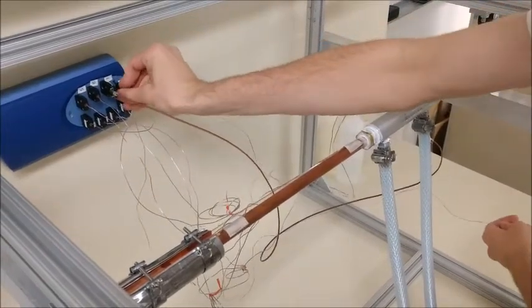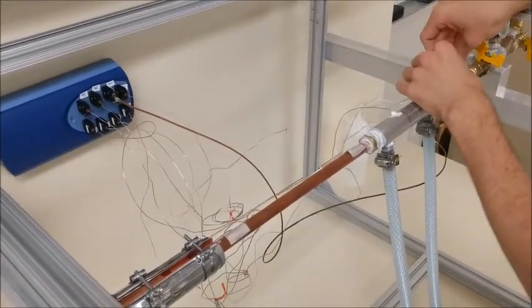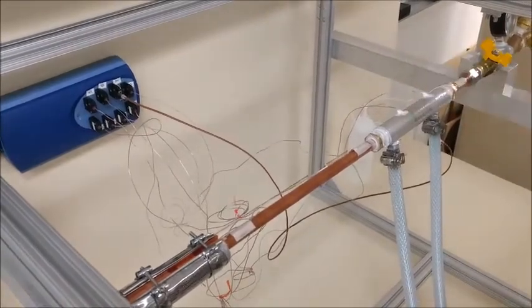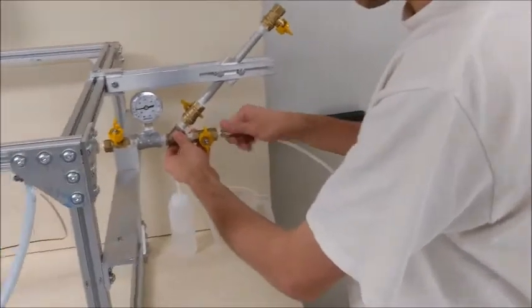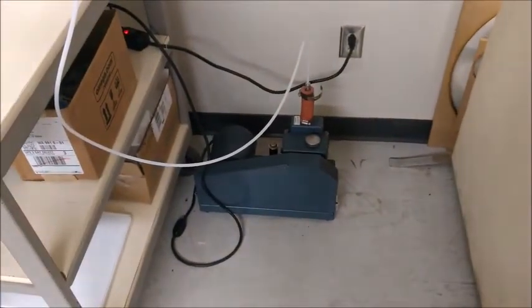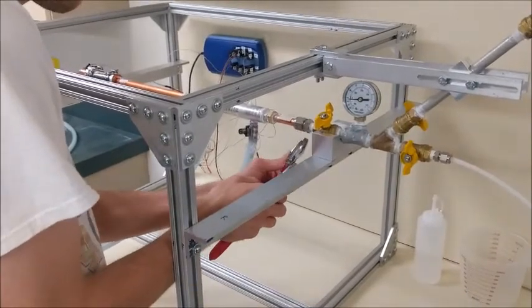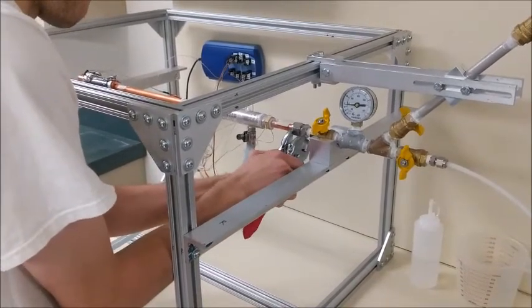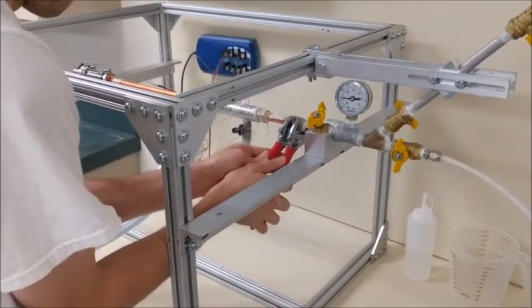Now we are going to put on the insulation pole on the end to make sure that the heat is coming out through the condenser section and not hitting the other end of the heat pipe. However, this one can be moved to different locations if necessary. Now we are going to put on the vacuum pump tubing — this one does not have to be extremely tight because of the valve system. Next, we are going to tighten the heat pipe to the valve system, and for this one you do want to make sure that it is extremely tight, otherwise you will lose your vacuum in the heat pipe.